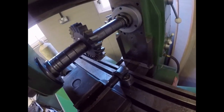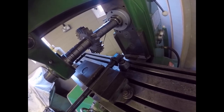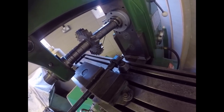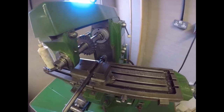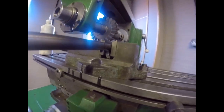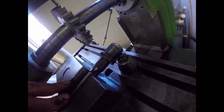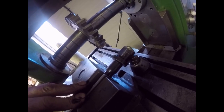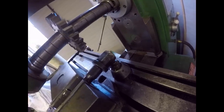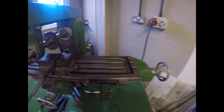Nice flat job done. I'm not going any wider than that because I don't want to compromise the wall thickness of that piece of metal, which should really be solid but is actually hollow. That's enough — they don't have to be bang tight. Just thought I'd mention a couple of things about my setup: for parallels in the vice I used a couple of nuts, and at this side I've got an engineer's jack with a half-moon key on it to line the flat up parallel with the other flat. It's all worked very well. Horizontal mill job done.